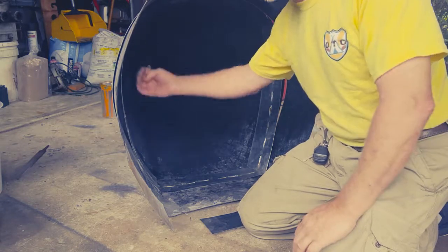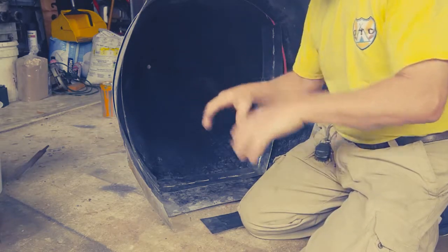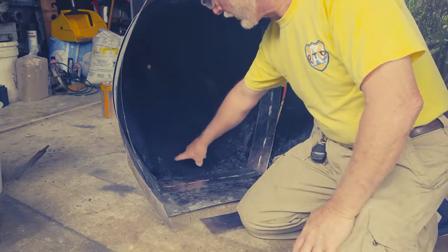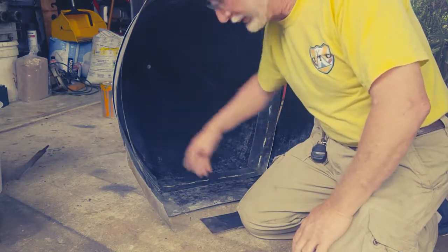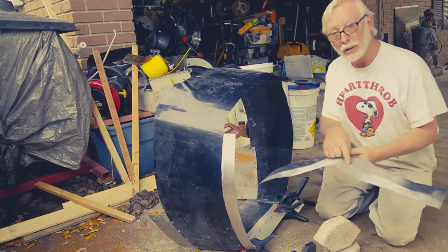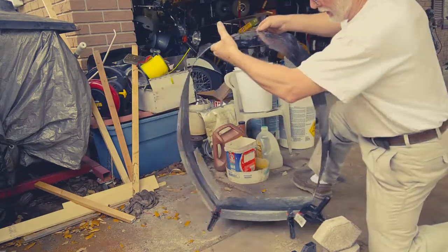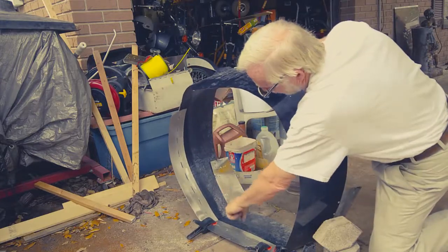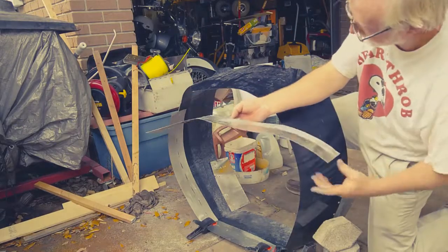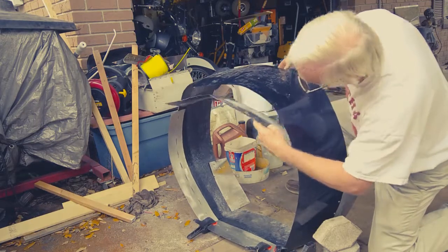When we get done, this piece will be in all the way around everywhere, so that'll make the two slide together right. This piece we want to laminate to this, but we don't want to bond it to that so it can still slide on and off. We're lightly sanding the panels and cutting these notches. The notches are then going to be fiberglassed to the body of the panel. We'll be pulling them with clamps, fiberglassing them in, and cutting them to fit.